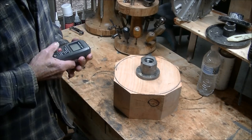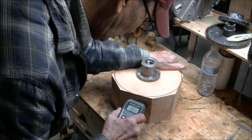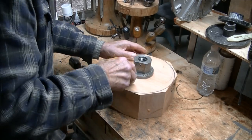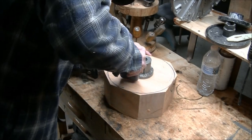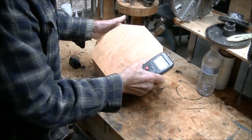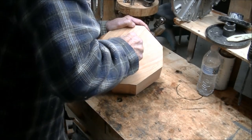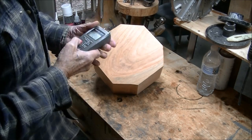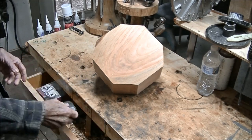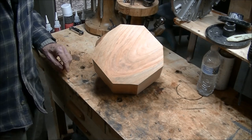So I'm thinking if we get it dry now and finish turning it, we might be alright. I've already checked the moisture but I'm going to check it for you guys. Coming in right at the pith — 18.3%. Up here near the face plate — 17.9%. And the bottom — 17.9%. So I guess we can say it's 18% all the way around. I'll check it again when we get it rough turned, see what it is inside and out, then put it in the dehydrator.